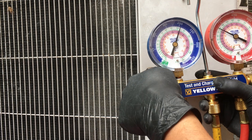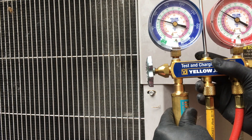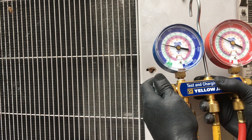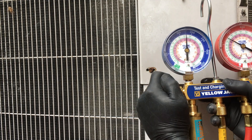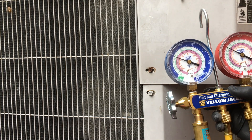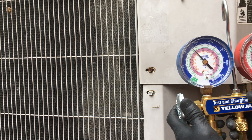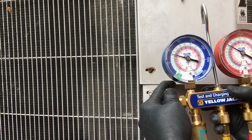The way you do it is just little by little. Now you're charging it from the suction side and you're going to feel this getting really cold. I don't see the compressor cutting off again, which is a good sign — that means the gas is above that threshold.